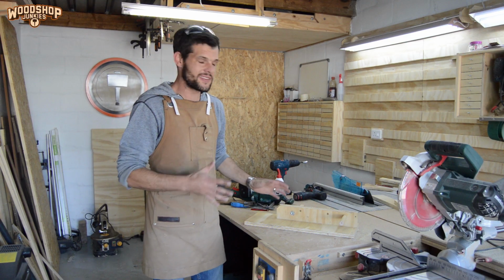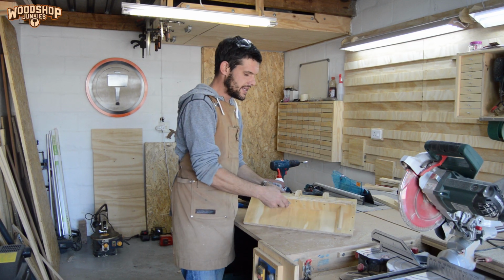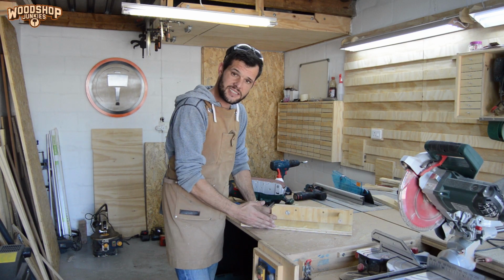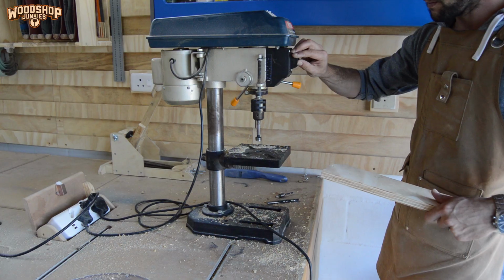It is also important that the cradle keeps the belt sander at a right angle with relation to the base. These two pieces are to assist with that function. So now I can add the other side of the cradle, but before I do I need to make cutouts to gain access to the dust port and the trigger.